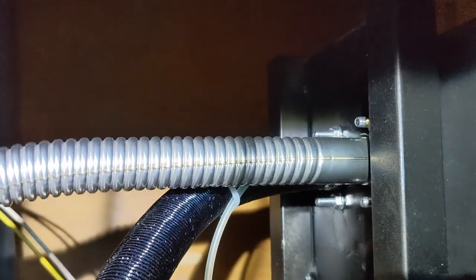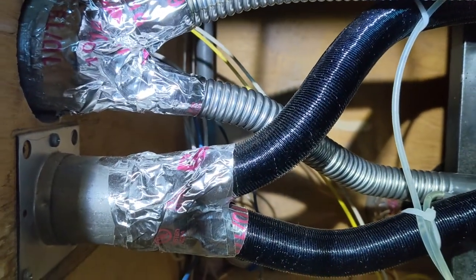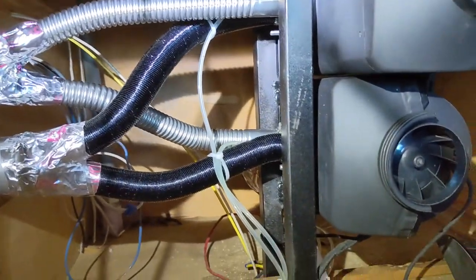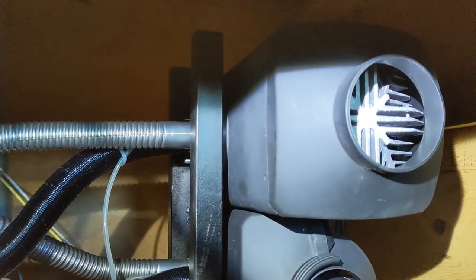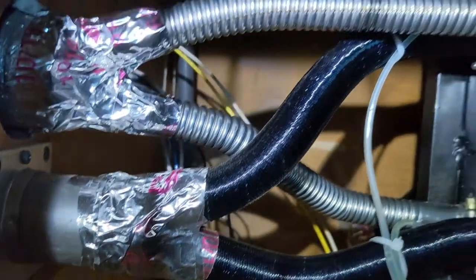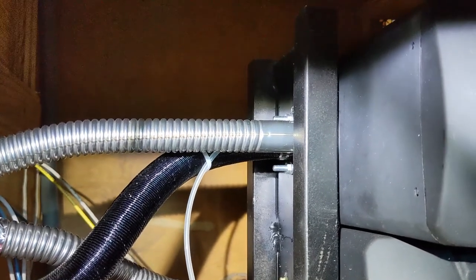Houston, we have ignition. This exhaust pipe is hot and it vents out through what was the original air intake and exhaust vent for the suburban propane furnace that sat back in this big space. It was not particularly efficient and we wanted to switch to diesel. So I vent both the upper and air intake on the lower through there, and we did that as a test for quite a while — it worked really well.